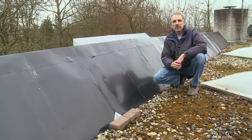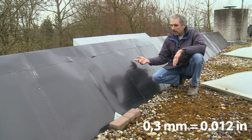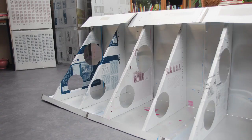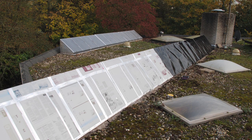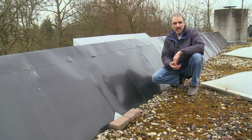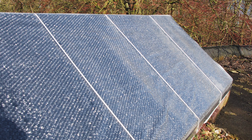This is the fourth collector. It's 13 meters long and has a collector surface of ten square meters. It's built of very thin offset printing plates, like the Sunduct collectors. It's a backpass collector, ducted by only two fans of 25 watts. This one has no glazing. These collectors are made of very thin aluminium and are very lightweight, so the first sign of wind will blow them away. Be sure to put a lot of brickstones inside them to give them some ballast.